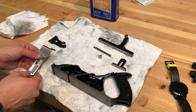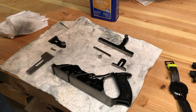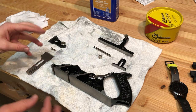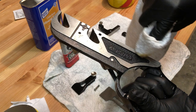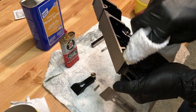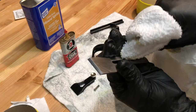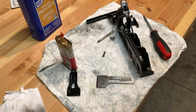After sharpening your blade and doing any other maintenance — in the case of a new plane there is no other maintenance to do — we'll move on to the final step, which is to protect. The way we're going to protect it is by putting some paste wax across all the different faces. Make sure this is non-silicone paste wax. We're also going to put some machine oil or three-in-one oil on each one of the different mechanical components so that the threads stay nicely greased. After all that is done, the very last step is to reassemble everything.